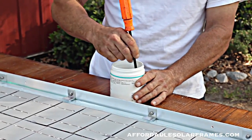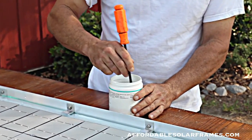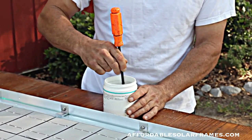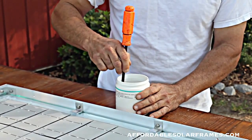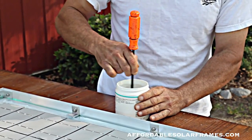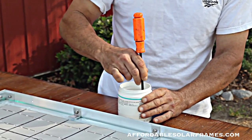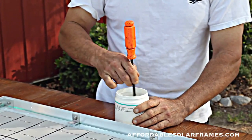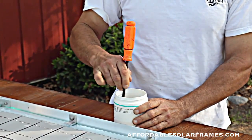You don't have to worry about being real thorough and complete with mixing — it will set up. I have a vibrator built into my table; it helps move everything around. I pour around the edges of three sides of the cell and not the fourth, just to let the air bubble escape. I also help spread it around with a paintbrush on the back side. When I'm done I'll leave the vibrator running for about an hour, cover it with a piece of cardboard, keep it in the shade, and leave it alone for three days.